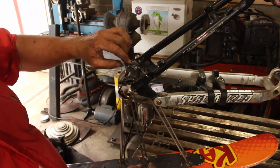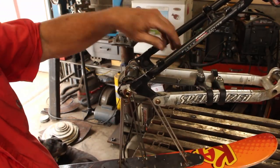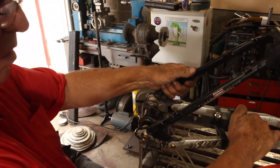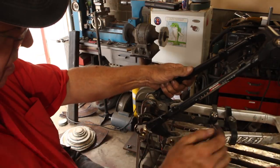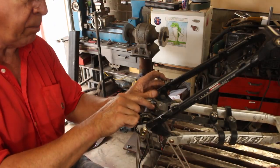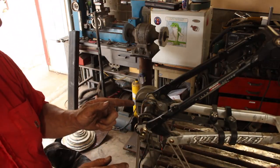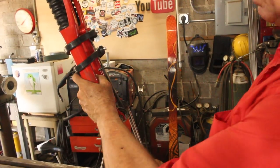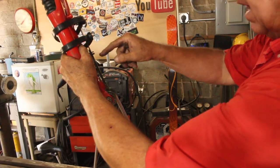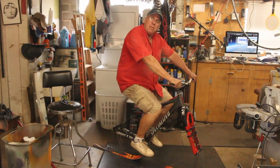Now if we take a look here, we have the lever tied to the rubber bungees — I added a third bolt in and it's the right idea. The bungee and the ski are tied together, except it's not tight enough. The friction, even with adding a third bolt in, is not tight enough so I'm going to have to weld this, but I'm not going to do that today. The same is true up here in the front — there's not enough friction going on between the hub and the lever so I'm just going to weld those together. But here it is — the fit is pretty good. It feels comfortable. I like it.